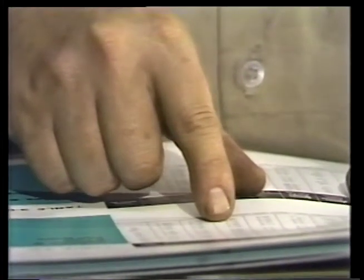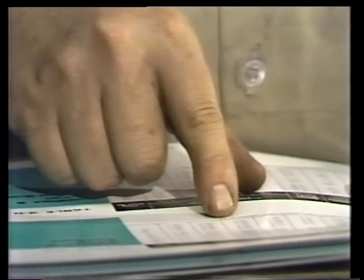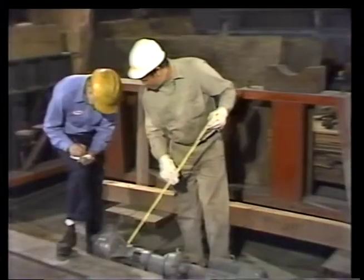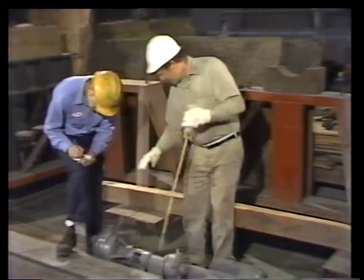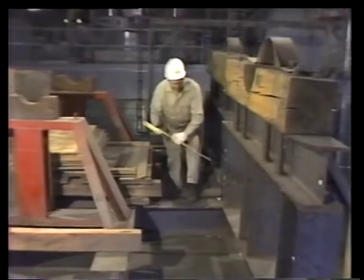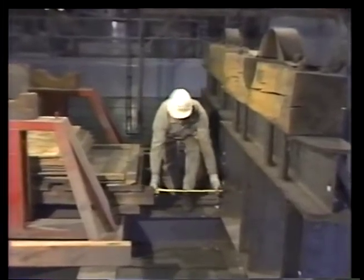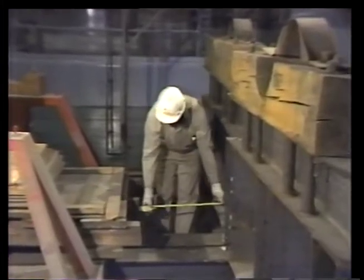First, find the weight of the load. Every piece of equipment has to be rated at least that high. Second, estimate the balance of the load. If the load must be leveled, you'll need an adjuster of some kind. Third, check clearances. It's awfully embarrassing to get stuck because you didn't measure the tight places along the way.